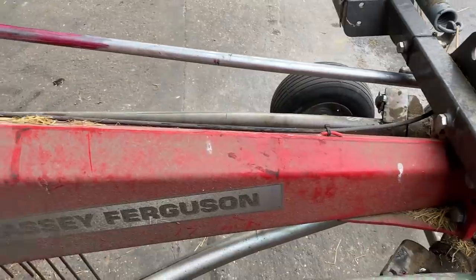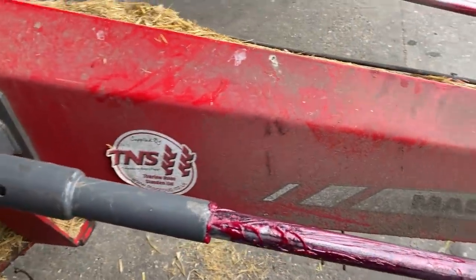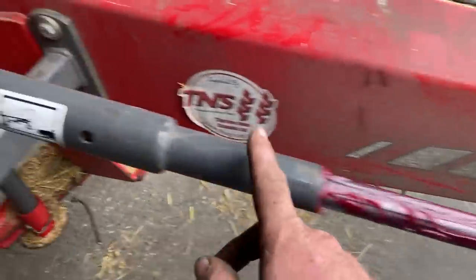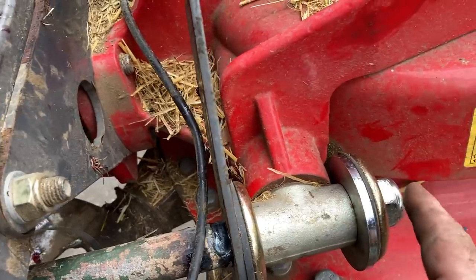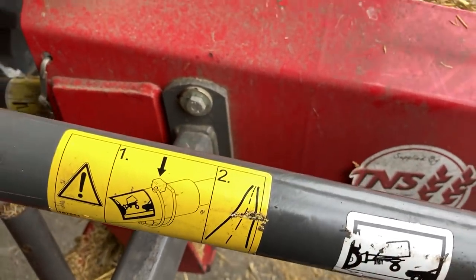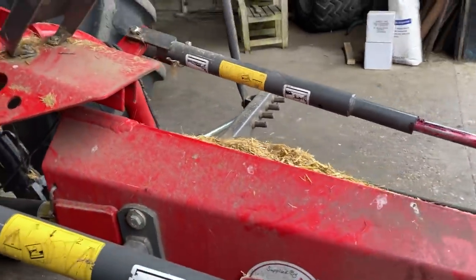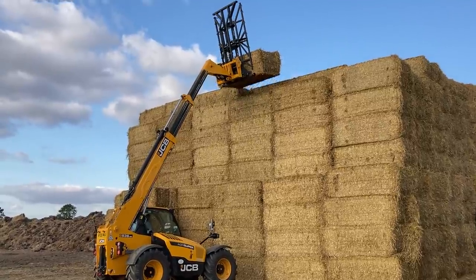We've put this all back together now - we just made another rod. We found a piece of hollow pipe, so we found some old nuts and bolts, took the nuts off, chopped the bolt heads off, and tapped them all the way along inside the rod to make it solid. I welded the bolt on the end, put the bushes back on, put the nut back on, and welded a collar inside - same as the original. You've got these two clips you can take out and put in to get it at the right position. Everything's all back how it should be now, topping off the stack.